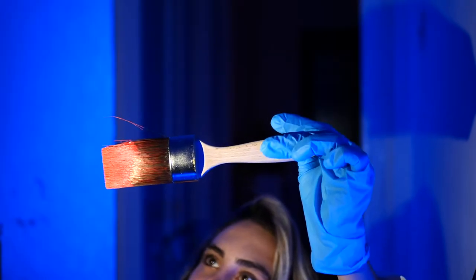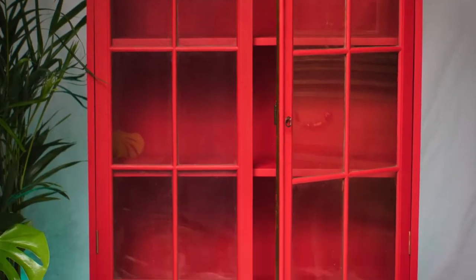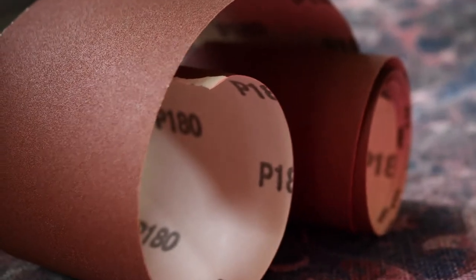After the color examination, we are ready to proceed with the operation, transforming a cabinet into a red retro piece. Shall we? I sanded the whole piece with 180 grit to take the shine off, so the paint will stick